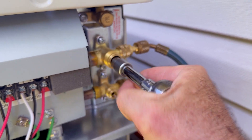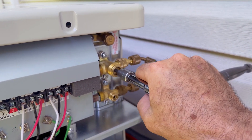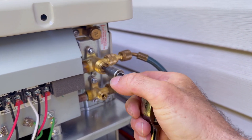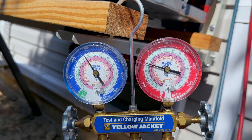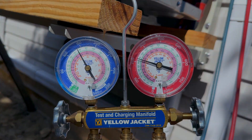I defaulted to opening the liquid line first — that's the red one. When you're opening these valves, open them up all the way until they stop, and then put the caps back on. So that's about it right there. This thing ought to run real smooth when it's done. Here's a shot of some of the refrigerant end — we're not quite done with that part yet, but you get the picture. Once it's all in there, it should be ready to go. Hope you've enjoyed this video. Thanks for watching.